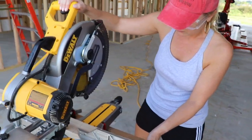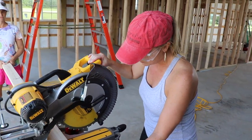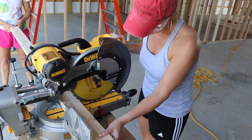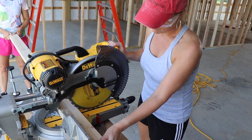Okay, so you've used a saw like this before? No, not this one. I mean, I've used a chop saw. Okay, so the blade needs to be on the right side of the line. Okay, that looks good. So bring it up a little bit. And then when you start it by pulling the trigger, make sure it's not on the wood when you start it.